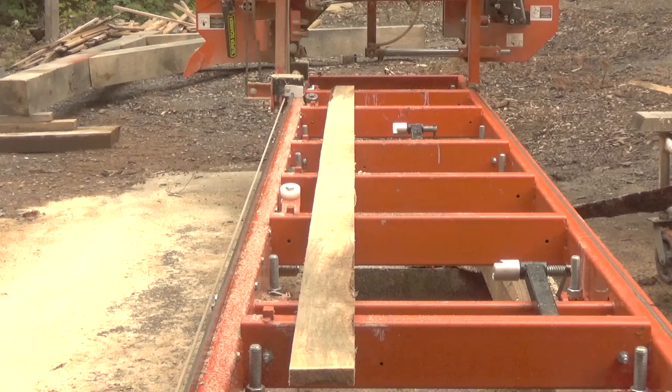And sometimes it pays to cut that out of there and then have yourself a nice looking board, because there's only 1, 2, 3, 4, there'll be 5 knots in the 8-footer and each of them are less than an inch big. So, you know, premium lumber there if that's what you do to it. Otherwise, because of the wane, you're going to have to call it something slightly less.